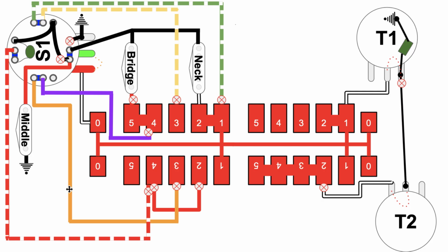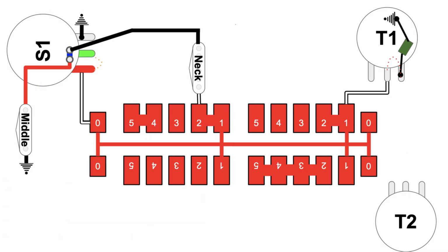If you pause it, you can study this and check my math or however you want to do it. But these are the things that come out of circuit. And again, the reason I'm doing this is because this shows you what to test with your multimeter. If you're looking to say, hey, is it working the way it's supposed to be working, this shows you exactly where to put the leads of your multimeter to test for continuity between two parts of the circuit. And also you can test for continuity in parts of the circuit where there should be none. This helps you understand where you can do those tests. All right, so let's go here. We take those connections out, and let's just check it out.